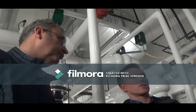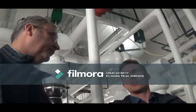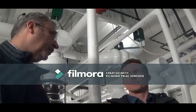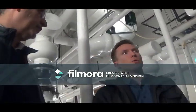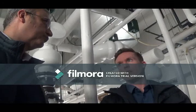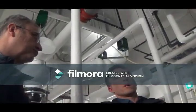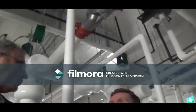The three big things to touch on are cleaning the burner, cleaning the exchanger, and then doing a combustion analysis and going high fire. Exactly, because if you clean the burner and the exchanger and your combustion is way off, then you'd be back here in a couple months. So that would be a yearly process. It's an easy process to do all that. Typically, per boiler, you're looking at maybe 3 or 4 hours.